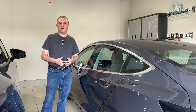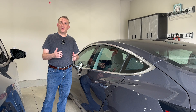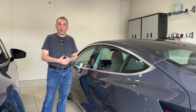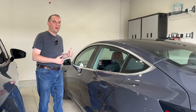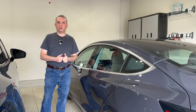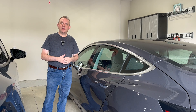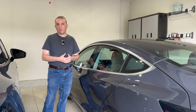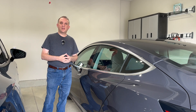There is also a disadvantage to having a hardwired charger: if you move, you can't take it with you. Most experts say a hardwired charger is the best way to go, and in this example we could actually have a faster charger if it were hardwired. The equipment we have here is limited to 32 amps and seven kilowatts, whereas you could easily go up to 11 kilowatts if you had a 60-amp circuit.